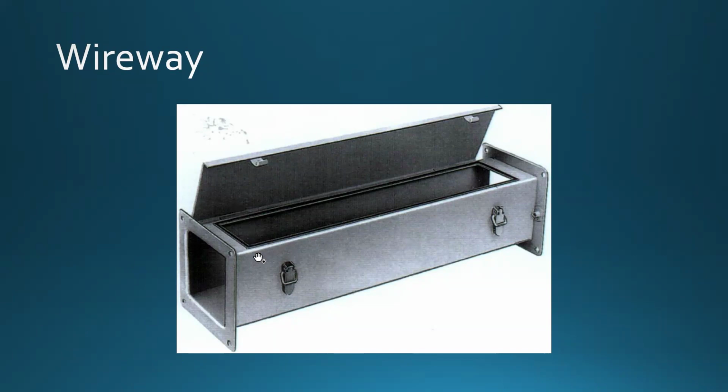Problem was that sometimes when things are being changed, remodeled, retrofitted, and whatnot, if you have to install some new wires, and some of the old wire that's existing is not going to be used, but you're going to have to pull new wires in there, please remove those old, unused wires, because the most common problem with these is that people run new wires, but they don't remove the old wires.